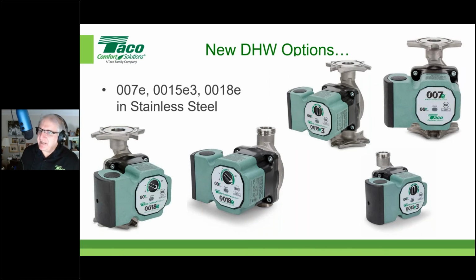Now the 007E is about as simple as it gets. It's an ECM circulator. It's a variable speed circulator, but there's only one setting. It's a 10-foot head constant pressure setting. If you were to use this in a residential application just as is with a smart plug, you might find that that 5 minutes on, 10 minutes off thing is going to save you. But you might find that you need a circuit setter to get down to that 1.6 gallons per minute limit, depending upon the hydraulics of the system.